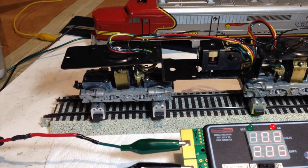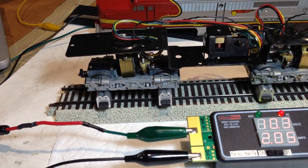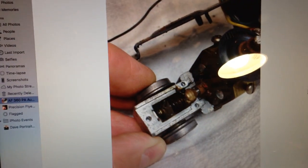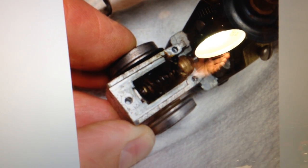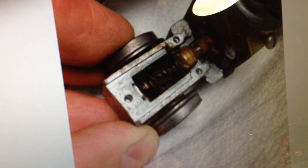Now I'm jumping over to a slideshow. When the engine was first opened up, this is what the motor looked like — as you can see, there's some pretty bad gunk in there. The armature shaft could not turn inside that bearing; it was positively seized with old lubrication that had congealed. And here you can see the bearings — what they look like when they start to wear out. They get oblong and a funny shape. The brand new one next to it has a nice, crisp, circular hole through it.